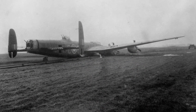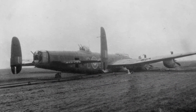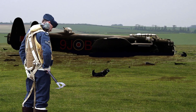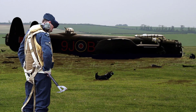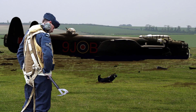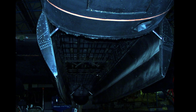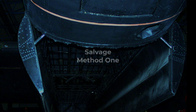When salvaging an aircraft after it had crashed on the airfield, there are 4 quick jacking methods that should be used. In using these methods, it is assumed that the aircraft can be moved intact and that no dismantling is necessary. The trolley arms should be to the rear, so that a man on each handle can assist in manoeuvring the trolley in turns. In each example, as soon as convenient, open the bomb doors, remove any bombs and close the doors.